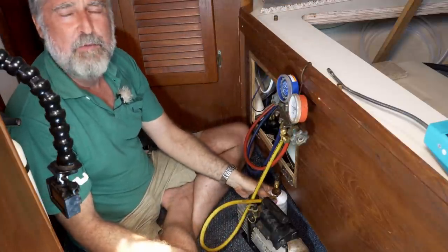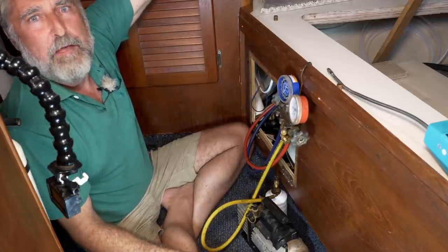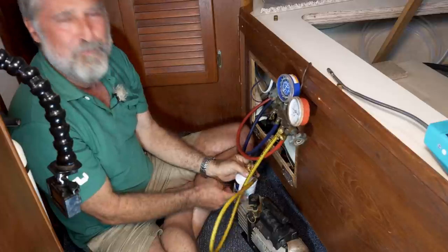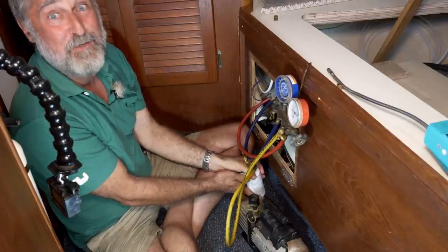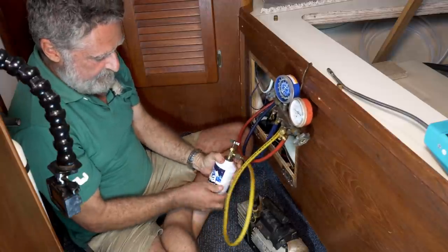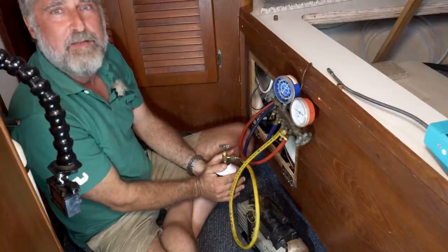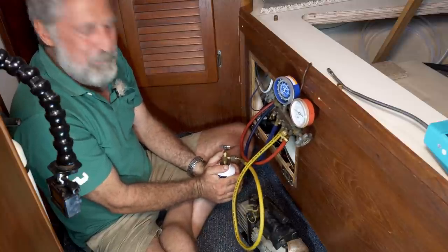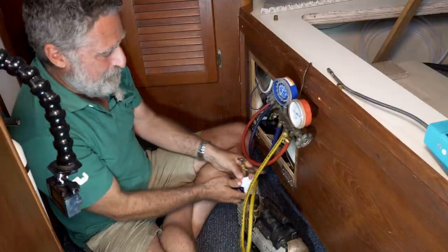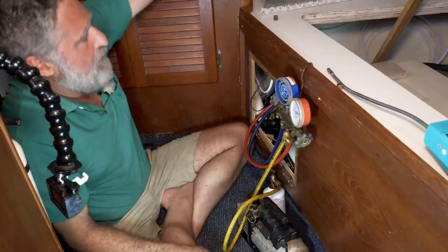While you're actually adding refrigerant, while the valve is open, don't expect it to get cold. It's just kind of blowing air at that point. What's really happening physically is you're refrigerating the can, and you'll notice it gets very cold. If you use small cans like this, when they get cold, they won't pass very much gas. You just have to wait till they warm up. You'll probably do what I do and hug them with your hands and try to warm them up. That raises their pressure, so the process goes. Anyway, let's go at it.